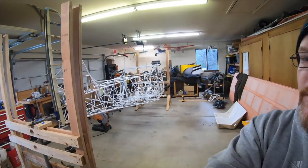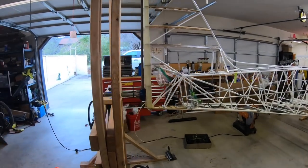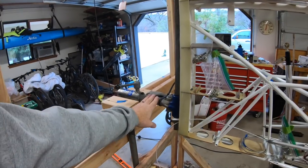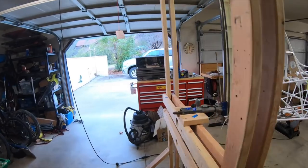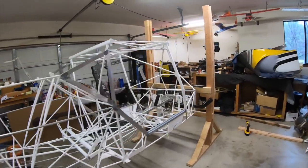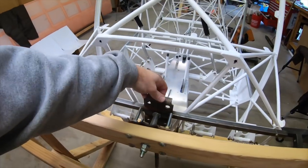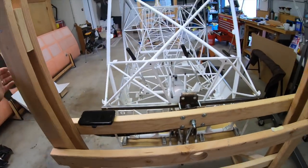Both wings are put to the side ready for paint. Today I went ahead and made a rotisserie. I'm not going to go into the details too much because it's not really reproducible — I used a mountain bike work stand that clamps onto a piece of square tubing that I put through the rudder attachment points. On the front I used some square tubing into the engine mounts along with some old leaf spring brackets, welded those on, and then bolted it into a piece of wood.